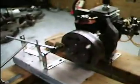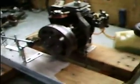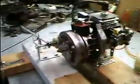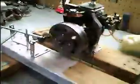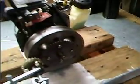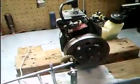But the real thing will come when I build my 4-stroke hit-and-miss engine out of, hopefully, a 4-stroke weed whacker engine, which I already have in storage. And that will act as a real hit-and-miss. It'll prop open the exhaust valve, and it'll coast just like that. That means I won't need a larger flywheel or a huge flywheel to compensate for compression, because there'll be no compression. It'll be freewheeling. So, that's it for now.